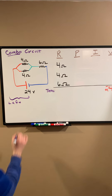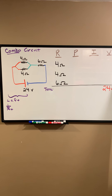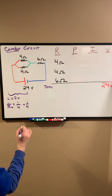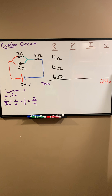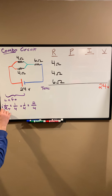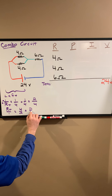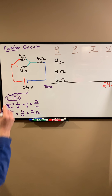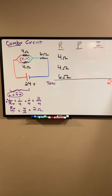On the left side, those two resistors in parallel require us to take 1 over total resistance equals 1 over R1 plus 1 over R2. That gives us 2 over 4. Now I want to take the reciprocal here — 4 ohms in parallel is going to equal 4 over 2, or 2 ohms on the left side of this circuit. Together, those make up 2 ohms of resistance.